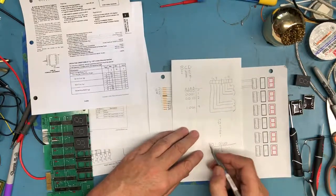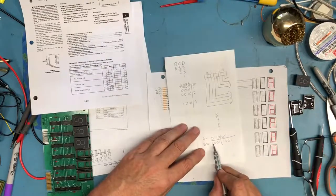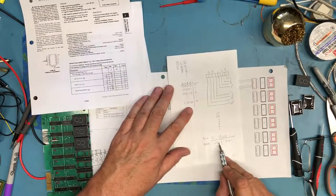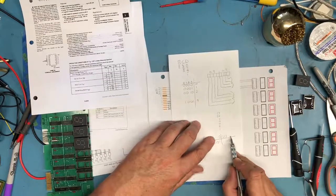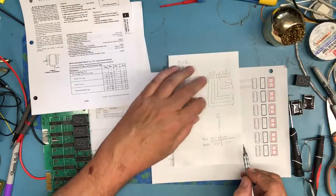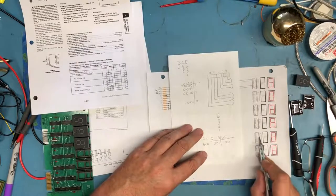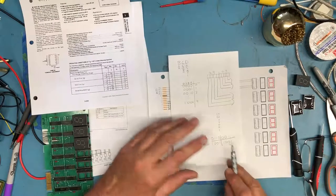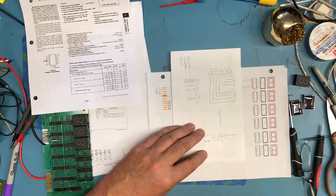So you can see here, this is BCD and this is binary. You can see here that this just is easier to look at. I can look at that and go, a 1001 is a 9, a 1001 is a 9. Whereas represented in binary here, I would have to decode that back out to get to something that's easier to decode, such as this. So it makes your logic easier because these devices expect a BCD coded input. It can make things easier to deal with in the computer and in the physical electronics.